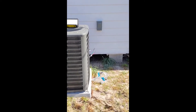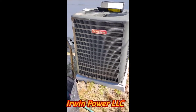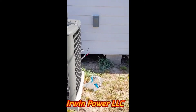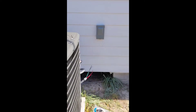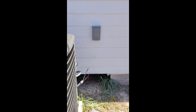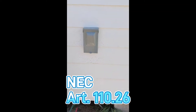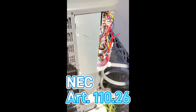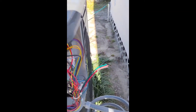Hey, this is Michael with Irwin Power LLC and I'm going to show you new guys how to wire up a condensing unit, which I'm doing right here. We have our disconnecting means on the wall. It's not directly behind the unit, so we're not violating our working space requirements for the disconnecting means. Now it can be disconnected and serviced when someone needs to come out here and turn the power off without having to have access inside the house.